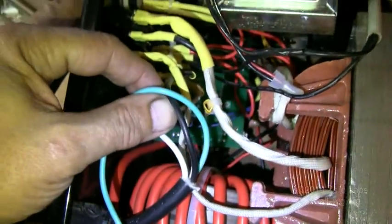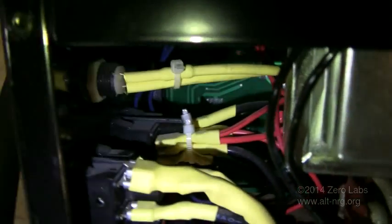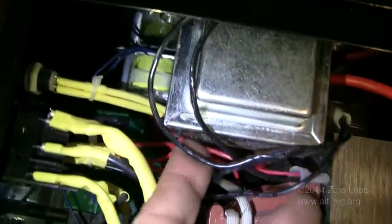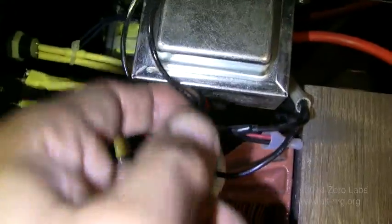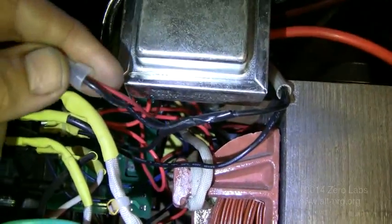The black wire on the power cord coming in is the AC hot. It comes to the main power switch down below — the terminal closest to you on this side. Those three wires connected to the power switch, tie-wrapped together — two black and two red coming off of that. One thin black wire goes to one side of the primary for the transformer I added, and the other side is crimp-capped to the wire extension that runs to the output of the switch relay.